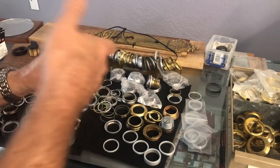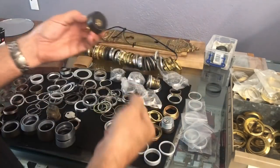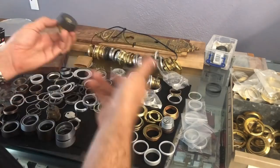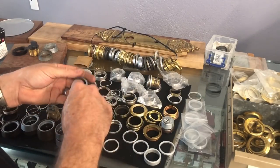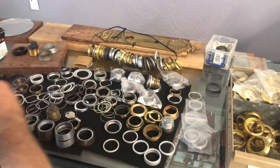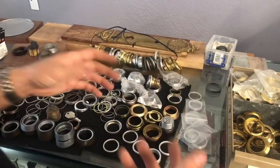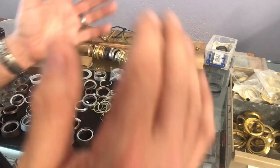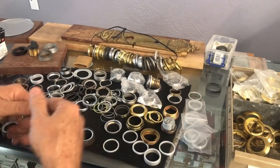This steel ring is metal, and that is what helps against wrench attacks. For those who don't know, there's an attack that lets you twist the cylinder out and open the door — very destructive, messes up the cylinder, and it's obvious it happened. But the security ring protects against that. I don't sell a lot of these anymore because most break-ins on glass doors people literally smash their car through the door. But the security ring is there for more targeted attacks.